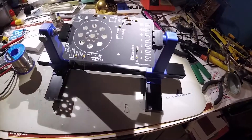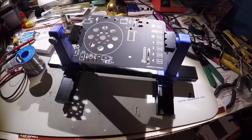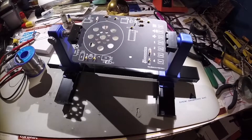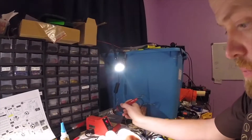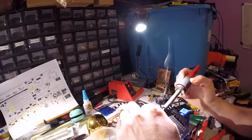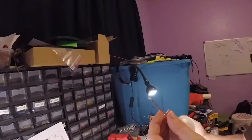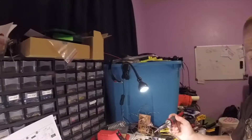So it says D1. We've managed to get a solder bridge. Is that bad or is that good? Well, it just means it's not right. So we're going to try and wick up some of the solder using desoldering braid — which I just did. You can see the solder got wicked up right there. And now we can re-solder our joint back together.